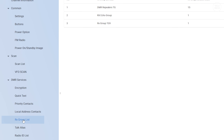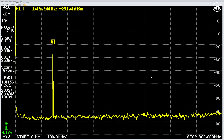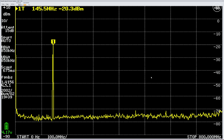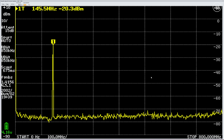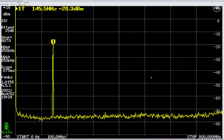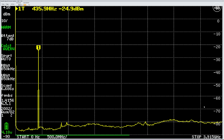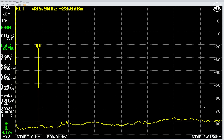In a past video it was commented that I was putting too much power into the TinySA, so this time I've added more attenuators while still running the radio at full power. On the 2-meter band at 145 MHz, there are absolutely no spurious emissions — all we can see is the fundamental. On the 70-centimeter band at 435 MHz, the same result: absolutely no harmonics. You cannot deny that Retevis engineers have done a fantastic job designing filters that make this radio legal in the US and EU.